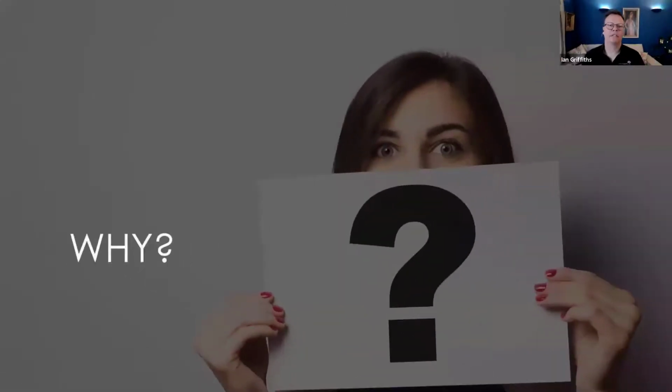So, earth resistance testing. Why do we do it? Once a new electrode has been designed and installed, we need to verify that it'll perform as we predict it will perform. In the same way, if it's an existing electrode, then we need to know that it's still going to be performing as we originally intended it to. So the most convenient and easiest way to do this is with a performance indicator to measure, and that is earth resistance, the resistance to earth of the electrode itself.